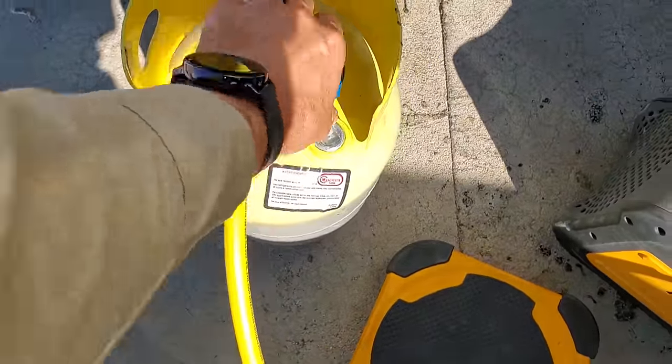There's a lot of this kind of equipment out there that you really have to be able to break down and know what's going on. In this situation, this customer used to have a smart hood system. The smart hood system would slow down and speed up their exhaust fans based off of building temperature around the exhaust hoods, and based off of smoke. They would have a laser running across a photocell or something across the hood, and if that got interrupted by smoke, it would speed up the hoods.